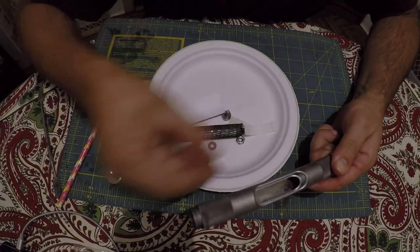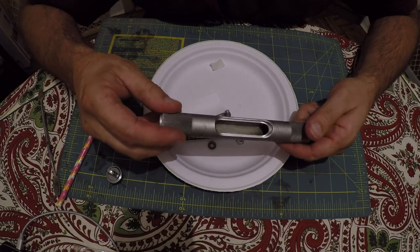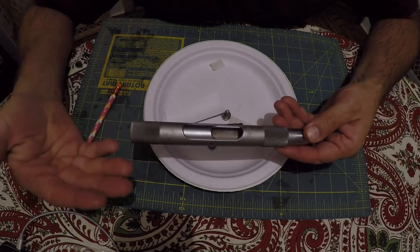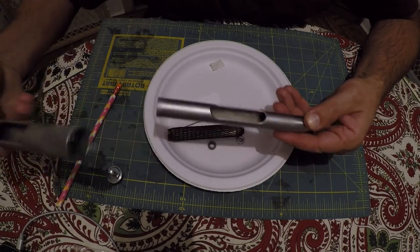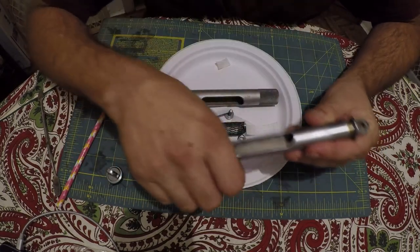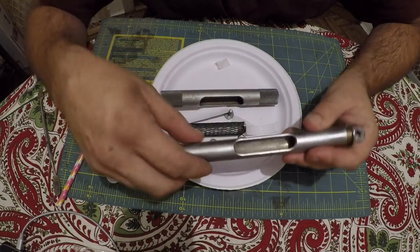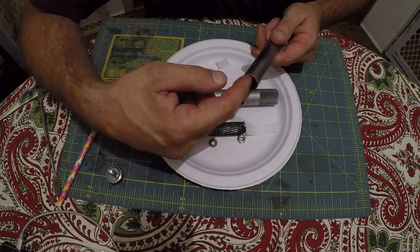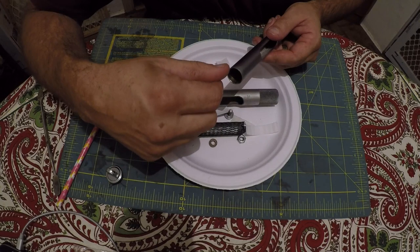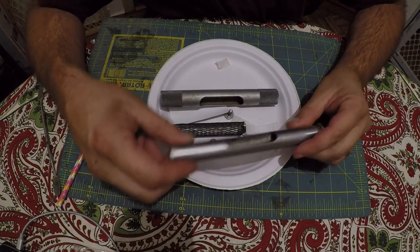When you go to slide this thing off, remember there's supposed to be a Teflon spring inside to give drag — this thing spins really free. Be careful when you slide it off that you don't drop and lose them; apparently that's a common problem. Once you've got one side out, don't try to grab the tube or you might crush or distort it. Find a drill bit that will just fit inside and bore out the plaster. Use a punch at the very end to knock out the bottom of the vial.